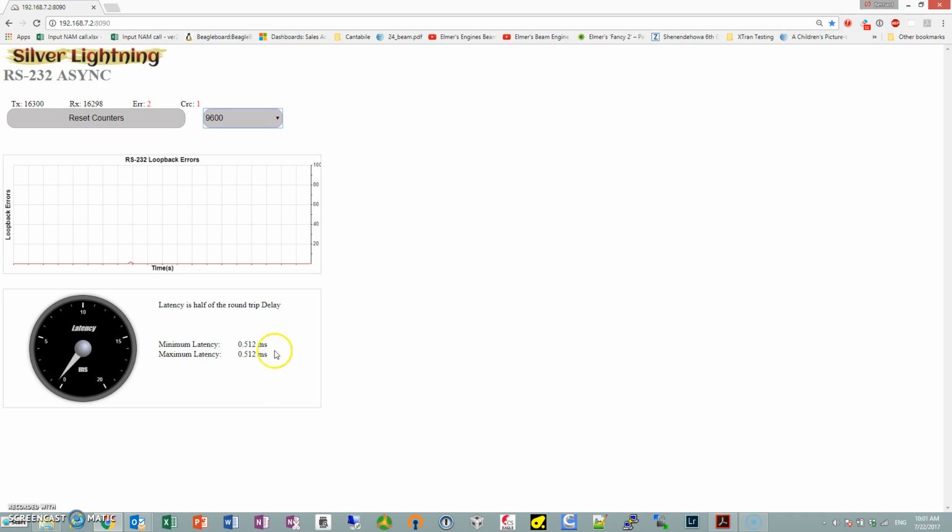So this is what you see right there, and I think it's the appropriate way to measure latency. It's really measured from the application standpoint and not just from the network standpoint. Of course, normally the way you'd use this tester is over some communication infrastructure, some kind of primary MUX or an RS232 port that is transported over the network, and there's a far end and a near end. So you would connect the tester on the near end, and then at the far end you would put a loop back, either a physical loop back or you set the far end port to loop back.